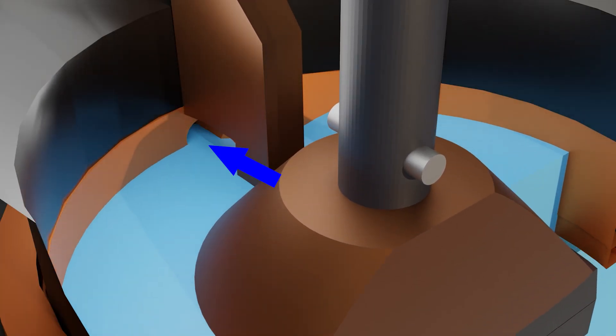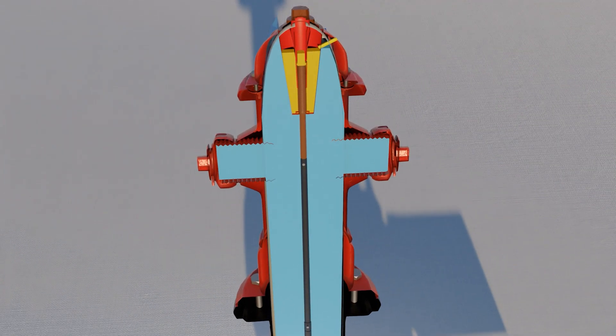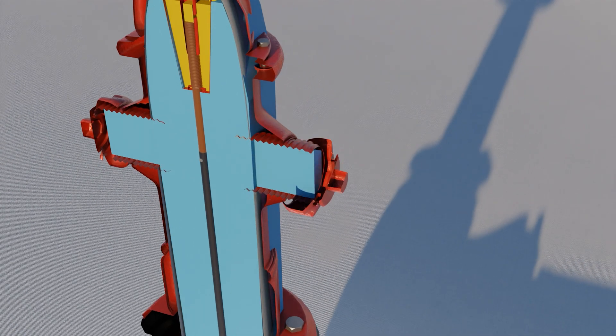As the hydrant is open, incoming water pressure force flushes these double drain valves and drain openings to assure that they are clear. Once the hydrant is fully opened, the drain valves are closed so water no longer escapes through the drains, and the hydrant fills. If the caps are opened, the water will flow.